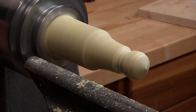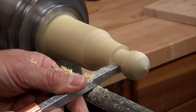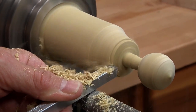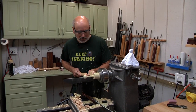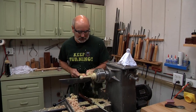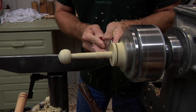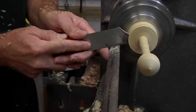Now I'm gonna switch to one of my fun tools — an easy wood tool — and we're just gonna take and push in. Since I'm touching both edges at this point, I'm gonna take it slow. There's our stem. Now we can just start moving the wood back. You can make the ghosts any height or any size you want. You can even grab a log off the firewood pile and make a big one, or make tiny ones and have a whole army of ghosts. I'm gonna make a clearing cut here so the tool doesn't bind, and on the last cut I'm gonna angle in a little bit so the outer edges touch — that way it'll sit nice and flat.